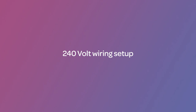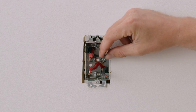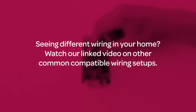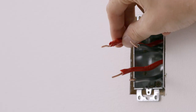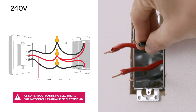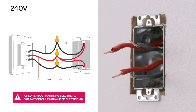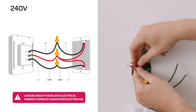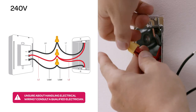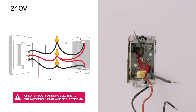We're going to cover the most common scenarios for 240 volt and 120 volt systems. In a 240 volt system, you'll see two black wires and two red wires. The black wire that brings power from the electrical panel will connect to your Mesa's L1 wire. The black wire that goes to your heater will connect to your Mesa's load wire. Connect the two remaining red wires together and then connect them to your Mesa's L2 wire — that's the red one. Remember, you're using the new wire nuts included with your Mesa to safely connect to your wiring.